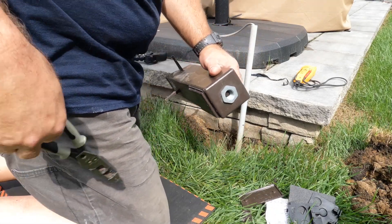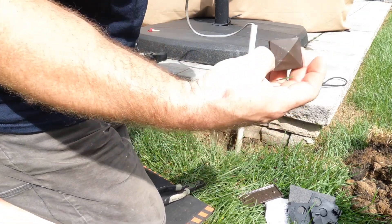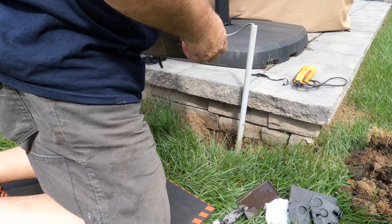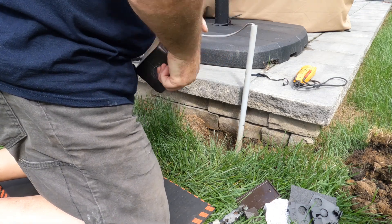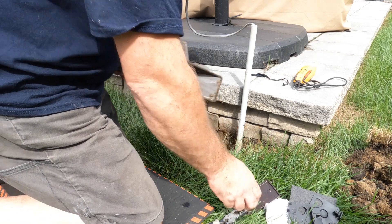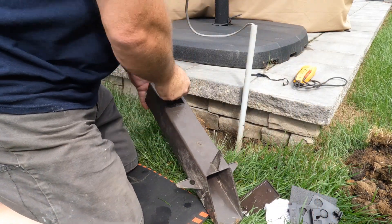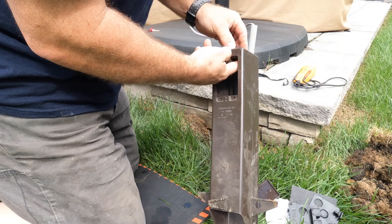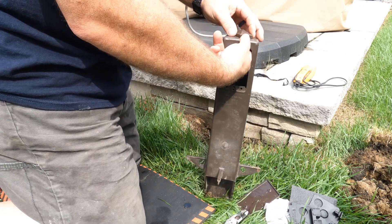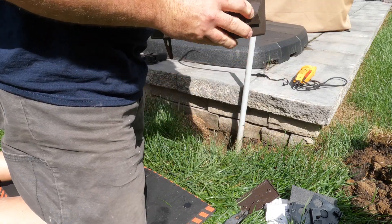This landscape box is nice — if you want to put a light on top you could do that, but we're going to put this cap on top instead so it's more decorative. It's a piece of metal, so it comes with a bonding lock nut. Since we're putting the plastic cap in here, no matter how hard we try we're never going to bond a piece of plastic because it won't conduct electricity. So we just put this cap on the lock nut and hand-tighten it — that's all.